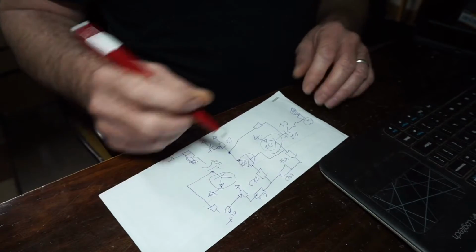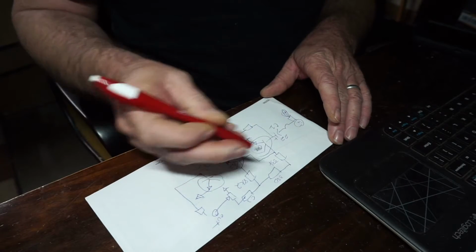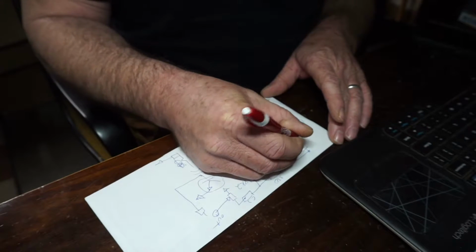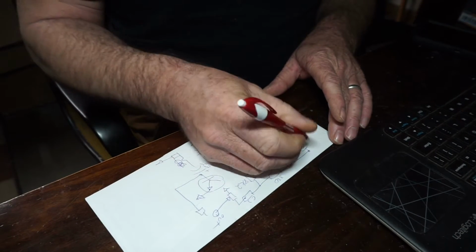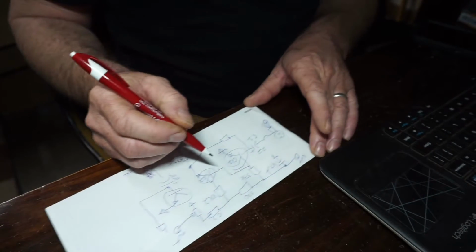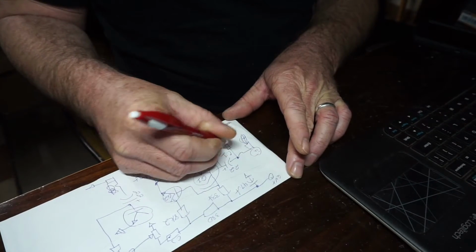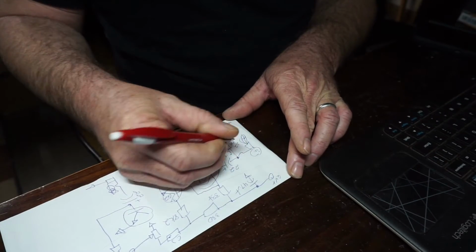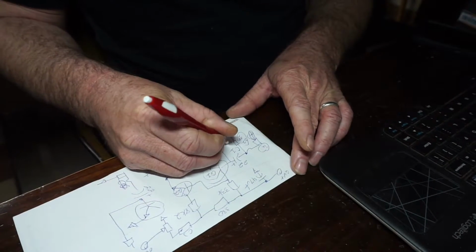And okay, now we're going to add a couple things. These were designed for batteries, so there's no power supply cap. We are going to add one. That will just be a 47 UF. Put a ground on it, 47 UF from our supply rail to our ground. And then that's going to be 9 volt plus in. Then we will add a pull down resistor before the cap. Ground that, 1 meg, no, 2.2 to 1 meg, 2M2, 1 meg, it's fine there. And that will be R1.